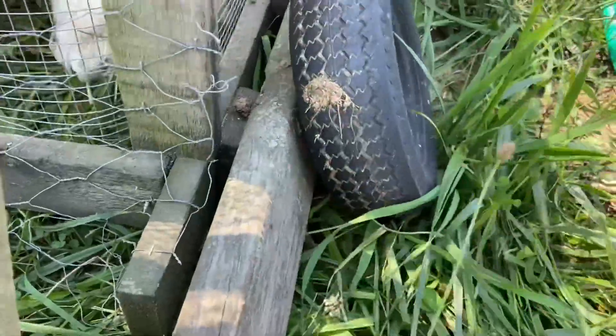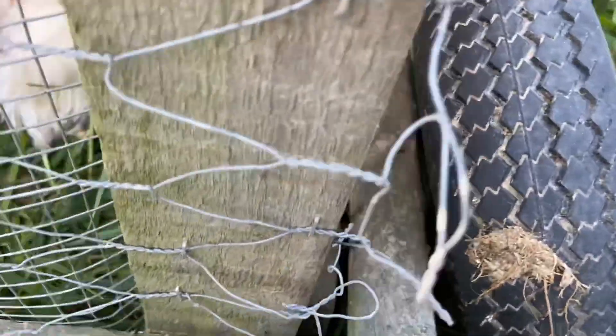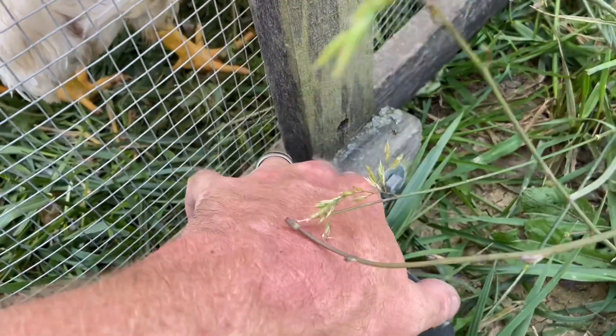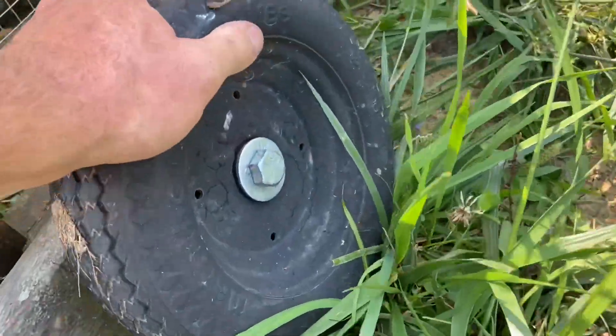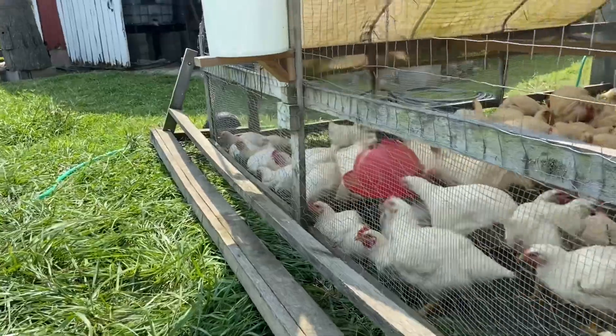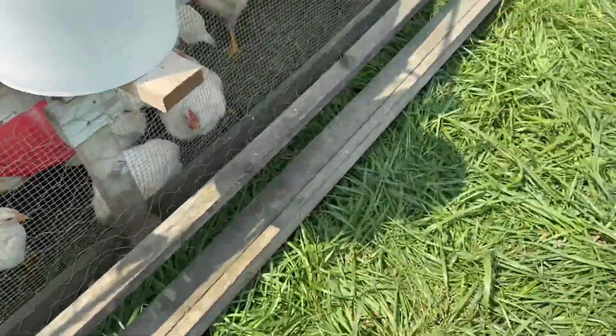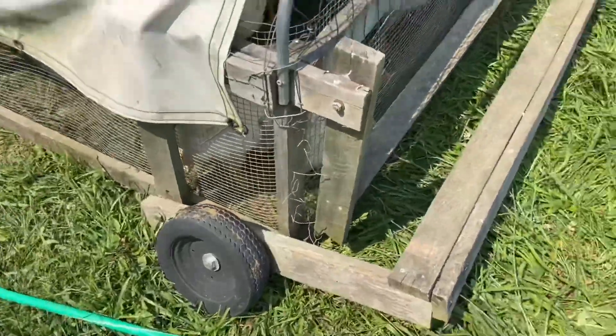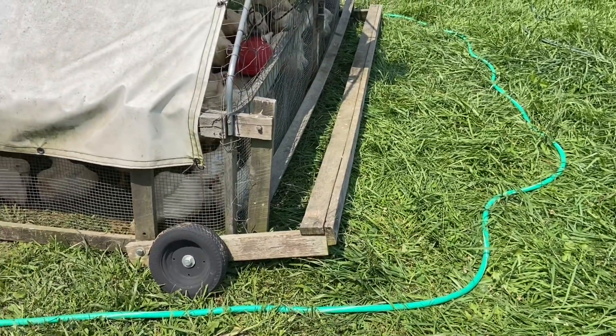On our wheel setup you can see how slanted they are — I just ran a bolt through here. The pivot bolt goes through those three boards, and what I would have done differently is put a metal bushing through there. If I build another one I'll do that, because the wood has given way over the years, but it's held up pretty well. Obviously the flat-free tires have worked out well — you don't want to be out here pumping those up during the season. But that's our setup to get this thing off the ground to move, and then you push down and it goes back into place when you're done. It's just been really easy — a very simple design.